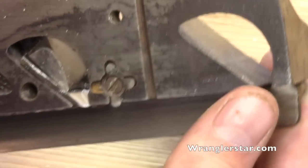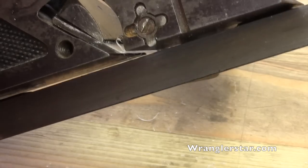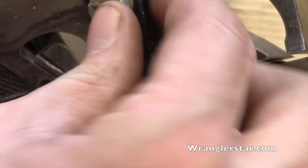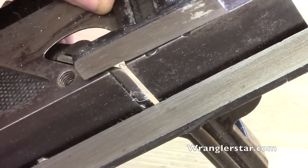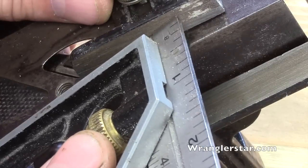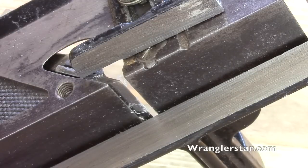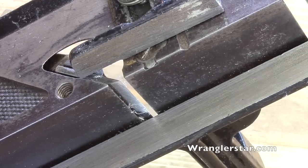That just makes sense. If you've noticed, the lighting is much better in here — I'm really happy with the studio lights I got. That really makes a big difference in this close detailed work. So now we'll have to reinstall the depth gauge. I've got my combination square preset, so it's exactly where I had it — that's a quarter inch. These have thumb screws on them, but I'll carefully tighten it down, just a little extra with the screwdriver. Now I'm ready.